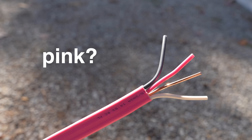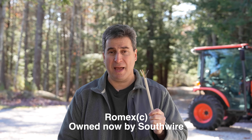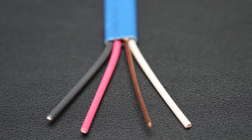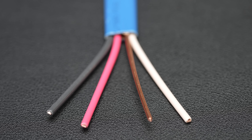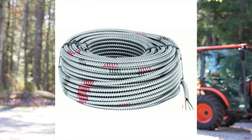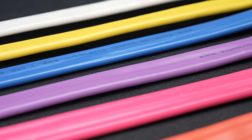There have been some big changes in the electric wire world, and that involves a product affectionately called Romex. Now Romex is in fact just a trade name — the real name for this cable is non-metallic cable. The wires inside are copper, which is metal, but it's the jacket that is called non-metallic. There is a version of electric cable with a metal jacket called BX or armored cable, but this video is specifically about the new colors of non-metallic cable.